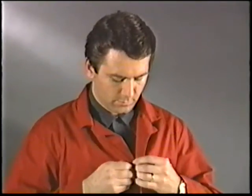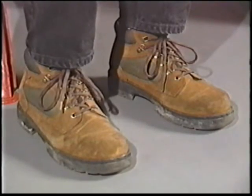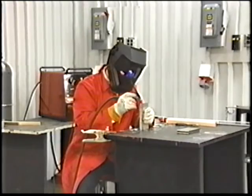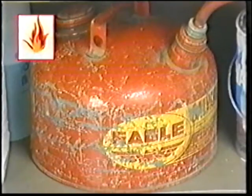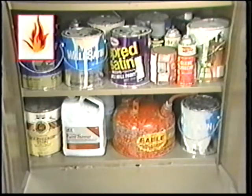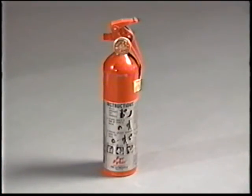Proper clothing is critical. Long sleeve shirt buttoned at the collar and wrists, protective jacket or shop coat, and dry hole-free leather gloves for TIG welding. Wear pants without cuffs and high top leather footwear. Wear safety glasses at all times. Be sure to have your work area properly ventilated and keep your head out of the weld fumes. Avoid fire hazards by keeping your workplace clean and free of fuels, chemicals, paints, solvents, and other easily ignited materials. Longer hair should be tied back or tucked under a hat, and keep a fire extinguisher handy.